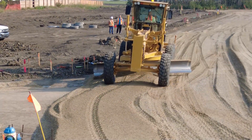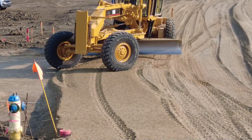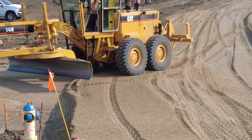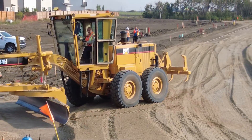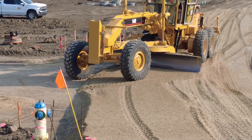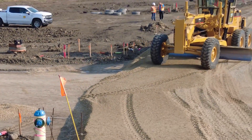This gravel will probably only have about two or three percent moisture in it right now, and optimum on it will be about five or six percent, so we have to water these berms pretty good before we pack them in order to get the required density.